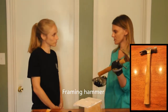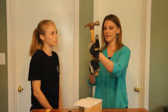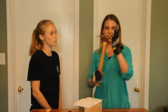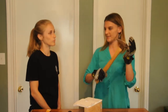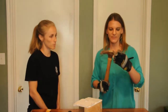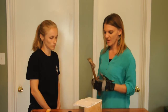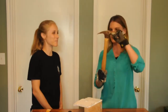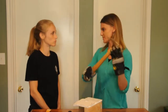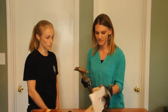A hammer is basically a large lever. So here, you are basically the fulcrum with your hand here, and then you are applying force in the middle of the hammer with that motion and the rotation, and then the load is up here, and you're basically amplifying the force with that. And so it increases the amount of force by accelerating it. It almost works on that wheel and axle principle too, where by rotating the axle, you've got a larger distance that you travel with the outer edge of the wheel. So with that, let's just take a look here.